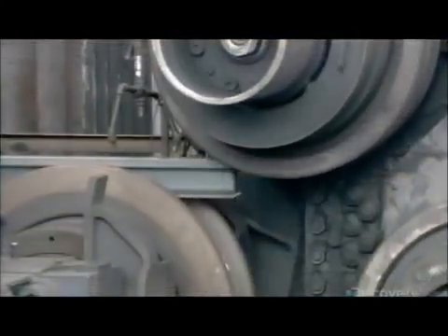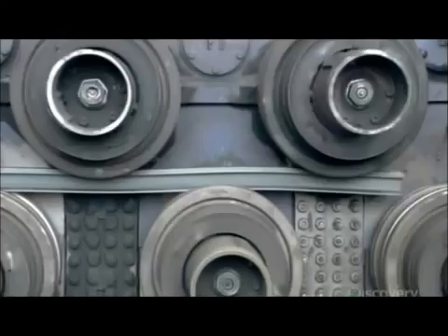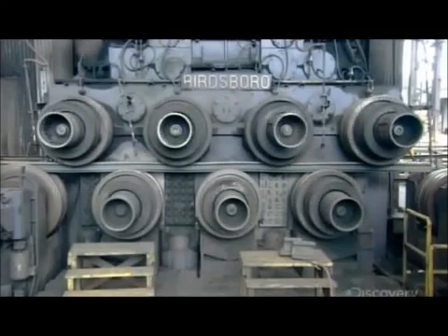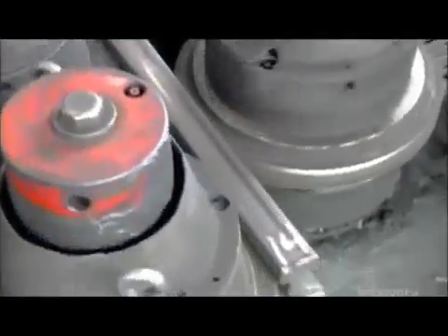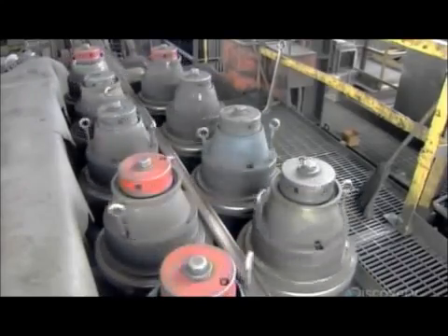When they come out of the box, they run through two sets of rollers. The first set flexes the rail vertically, the second horizontally. This flexing process straightens out the rails, which curve slightly due to all that heating, shaping, and cooling.